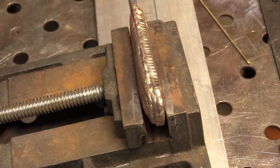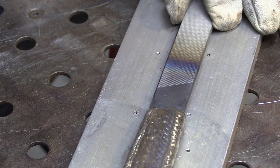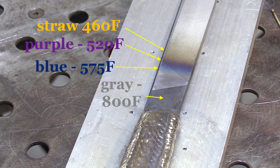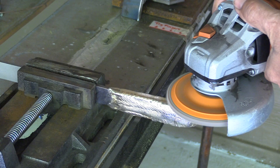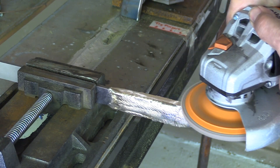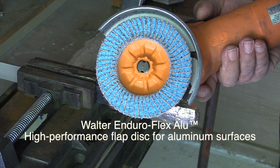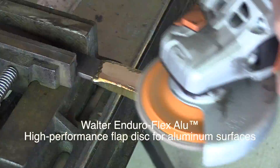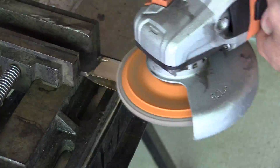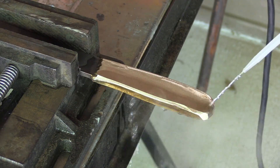A little more contouring, putting it in a vise, touching it up here and there, and it'll be ready to put the finger pieces on. There are welding textbooks and blacksmith forums that give you color temper charts, and according to what I saw, I only got a little bit over 800°F even in that fusion area — so it should be slightly annealed maybe, but not hardened. At the last Fabtech I got some samples of Walter Wheels Enduroflex Alu — designed for aluminum so they don't load up, but they work great for bronze too as long as you keep it cool. They took off a lot of material and left a good finish.